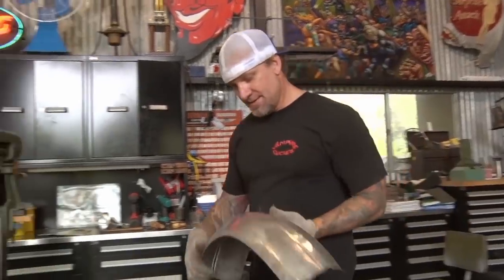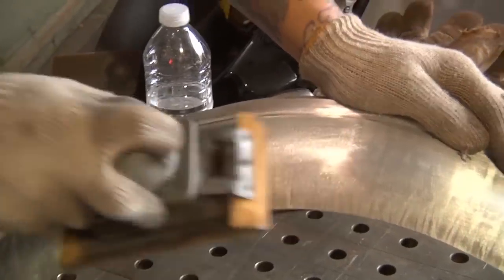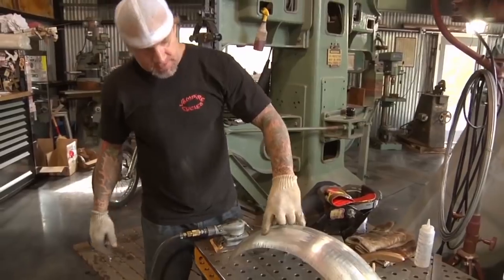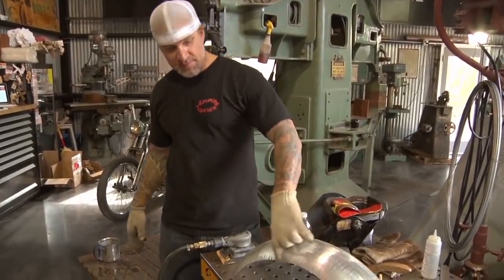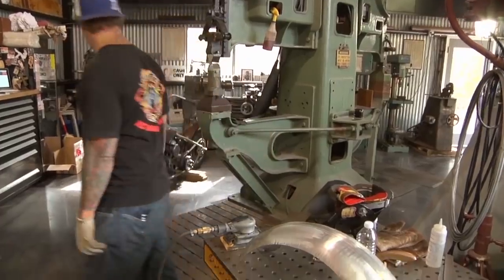I actually kind of like seeing that. Tire stripes. Yeah, because then I could look right at it and know how someone made it. Just like that, where you have a consistent amount of sand scratches and you're not seeing any of the low spots. I'd stay away from that. You can kiss that lower edge just to dress it, but it's going to get folded anyway. And sometimes that's what metalwork's about, showing some restraint. You could push so hard and keep doing these steps, but sometimes you have to realize when enough's enough, when it's done.